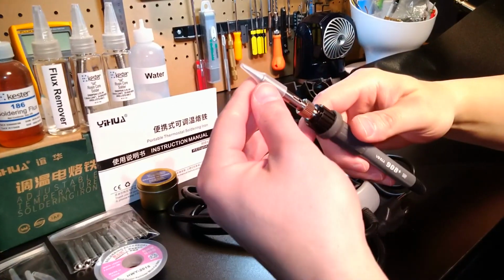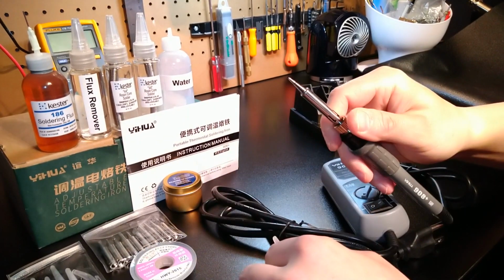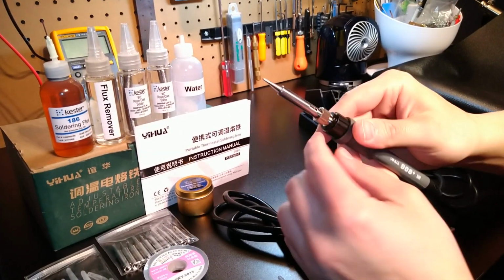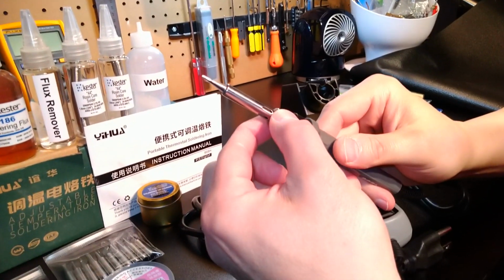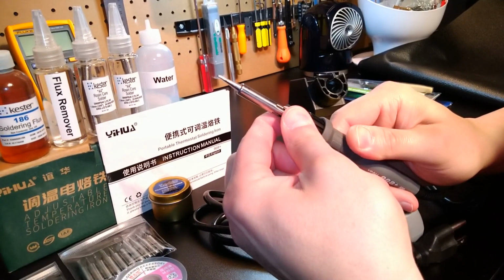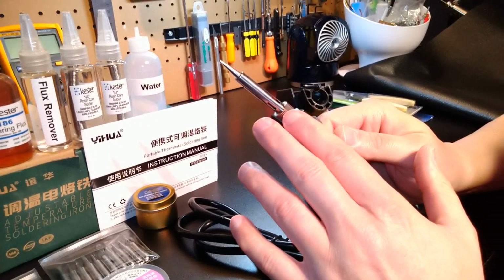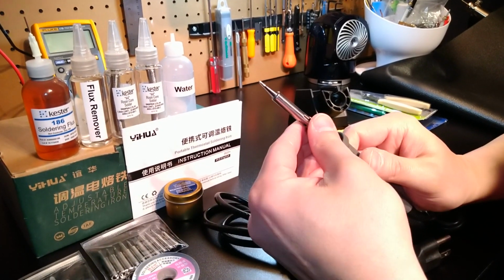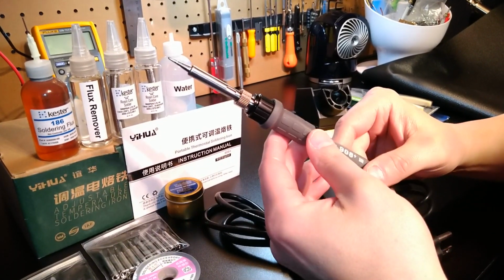As far as the iron, you can see you've got your protective cover over your tip. You lift it off. I recommend saving this as well. If you guys have to change your tip, you simply unscrew the actual barrel of the iron. Now, if you look over here on the iron, you can see the flat spot on it. I recommend using a nice set of crescent wrenches. Just set the crescent wrench and lightly tighten this. And I recommend tightening it, again, not too tight. You're not trying to use an excessive amount of torque. You just want to snug it up. As the unit heats over time, of course, the barrel will become loose. They all do because of the heat. You just naturally tighten it up. I recommend doing it maybe every second or third use, and you're set.